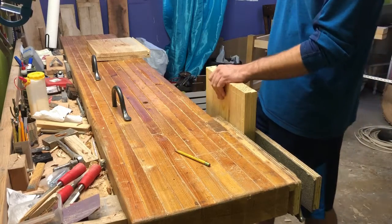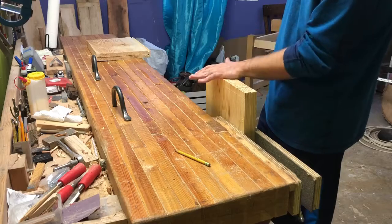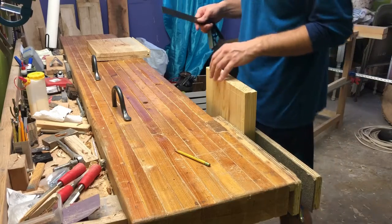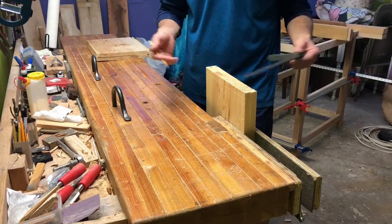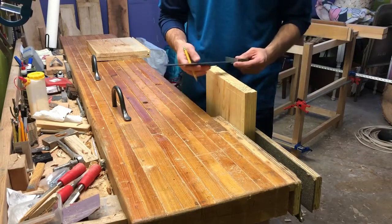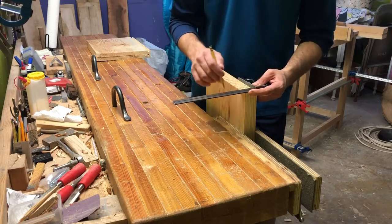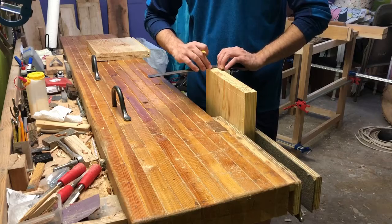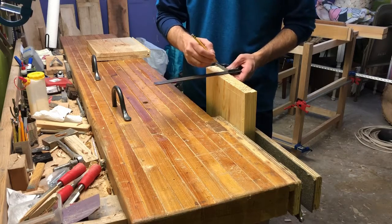I start with my tail boards. I put them together so I'm marking them the same on either side, so they match up — even if they're a little bit off or not perfectly dimensional. I start with my square on the outside on either end. I was way off with my first mark, anyway. I take the full width of the blade and do that on both sides. Then from there I'll do real light markings, blade width, all the way across.